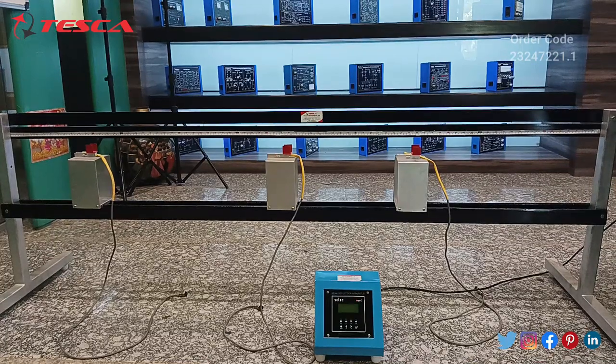We need to connect the three load cells on the back of this control panel. The connectors are needed to be connected on the back of this control panel, and the control panel has a mains cord which is to be connected to the main AC supply of 230 volt. So let's connect the three load cells to the main control unit first.